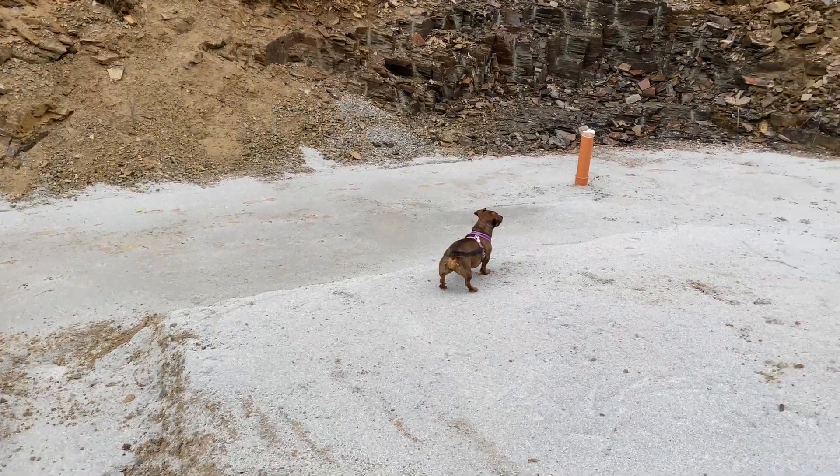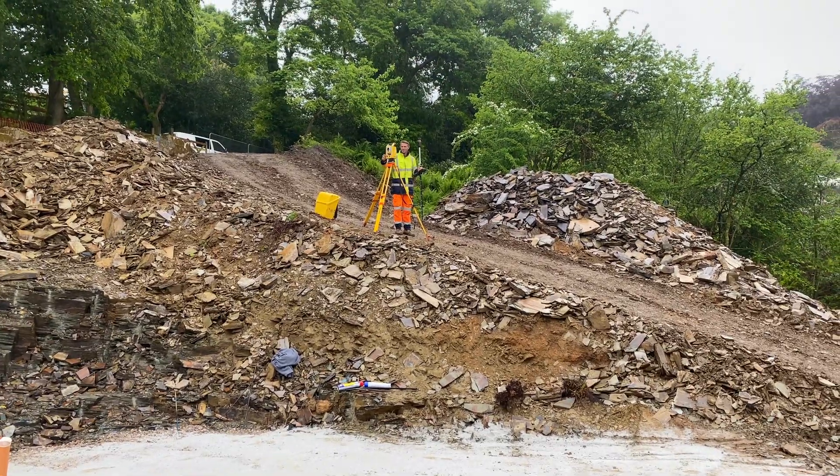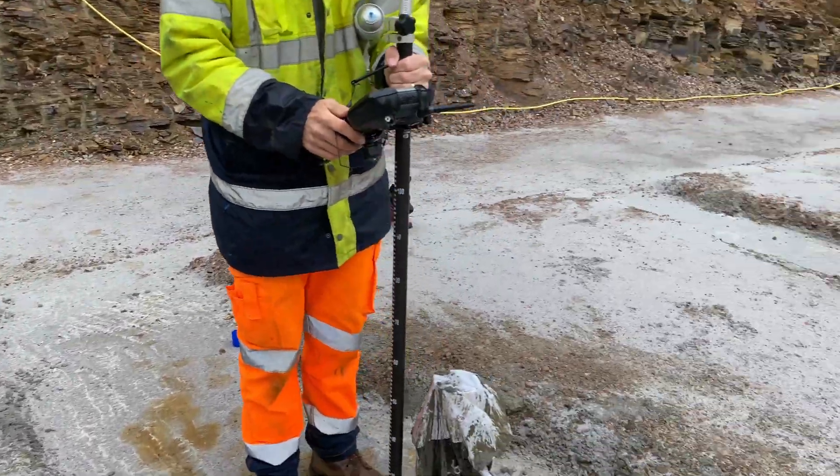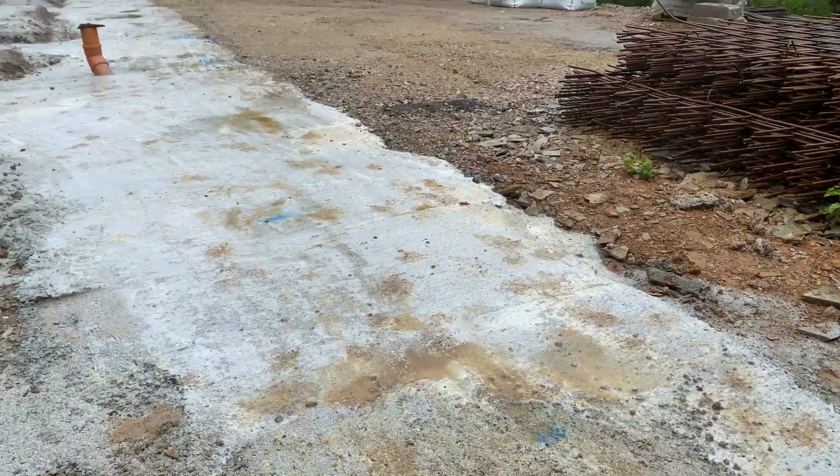I've just been on site with the dog and the surveyor and we've been double-checking the dimensions, making sure the X and Ys of the soil pipes are correct, making sure there's no howlers - we don't want a soil pipe coming up underneath where an internal wall is going to be. I'm pleased to say that's all good. That's going to save us money and time in having to get fittings to deviate through the floor makeup. We've also been banging in nails on site and marking out lines for the exterior of the slab.